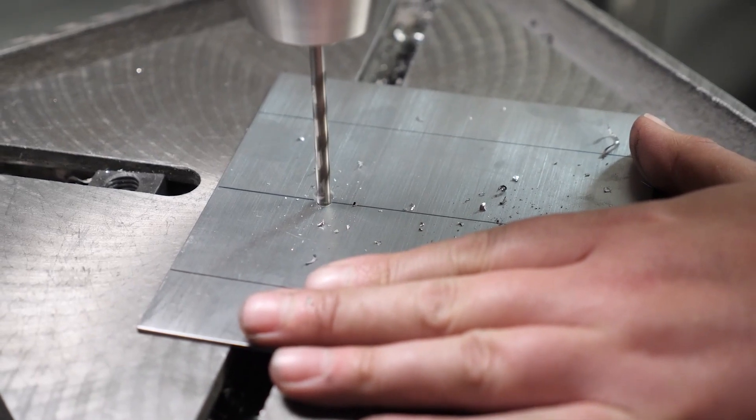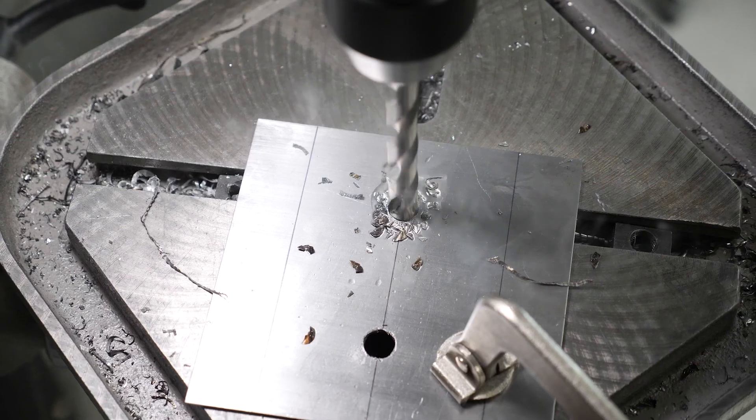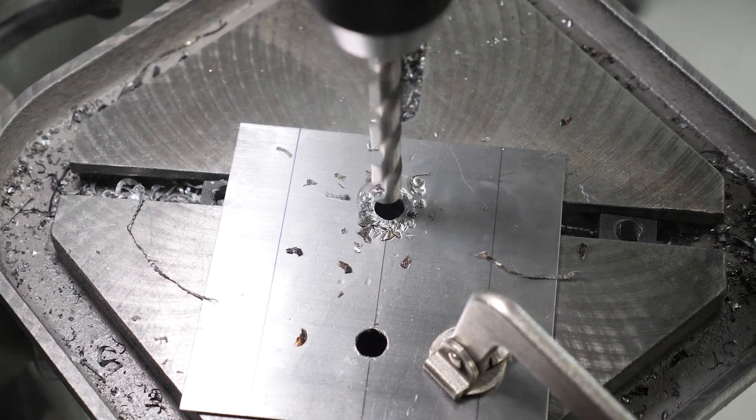The process is essentially the same as before, although in this case the centre bolt requires a 12mm hole to pass through. With our location marked and centre punched, we can drill a pilot hole and then follow up with our finished hole size. Once deburred, we can locate the two halves of our punch and flare tool on each side of our work piece, taking note of the direction of the flare. The tool is designed to be drawn together by tightening a threaded bolt through the centre, which works well particularly on thinner or softer materials like aluminium. However, with larger diameter dies on thicker steel, the thread can become damaged over time.